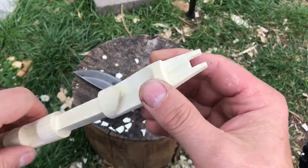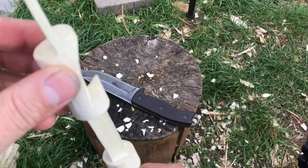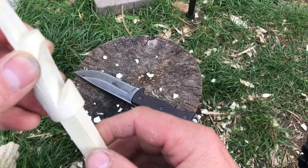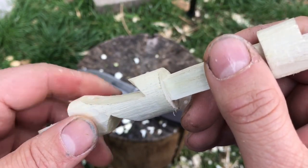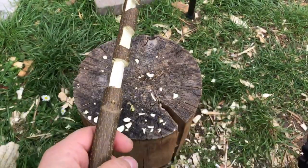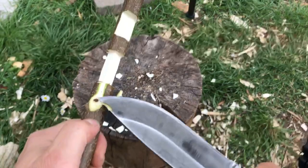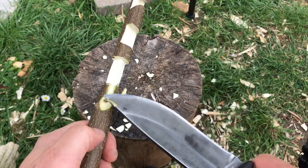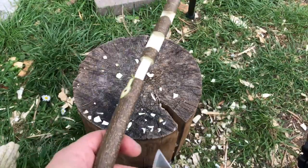The next one is the pot hanger notch. This differs from the figure seven notch insofar as it undercuts. The purpose of this notch is to actually make sure that whatever you hang on it stays on it — you don't want that slipping off. This is also a great notch for tent pegs. It's very similar but with this one we're going to have a curve and an undercut. Now back to talking about knowing your material — you will notice here we have a little knot. I'm going to avoid that because the wood behind a knot is usually much more dense and the grain doesn't follow a nice straight pattern, so it's a lot harder to work. We're going to come down from there and work on this section here for the pot hanger notch.